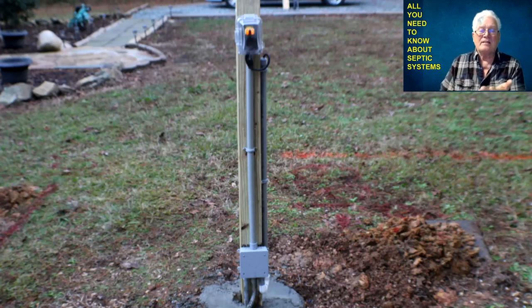So you've got the basics here. Cement the four-by-four post. The post is set in cement. Then add the electrical box on the bottom, as low as you can get to the ground. Make sure your wiring is coming up through PVC pipes so it doesn't get rained on, snowed on, or whatever. Let's go to the next phase.